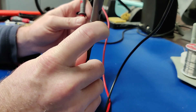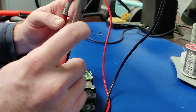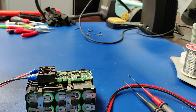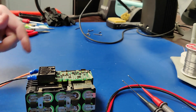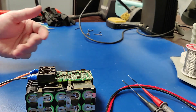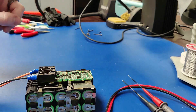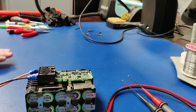Same with the rest of them. Basically I just watch it until it gets down to about 16 volts, turn it off, see where everything is at, and put it back on the charger. Some of these I've had to cycle them down about three times and put them back on the charger before it cleared any memory in the cells I just put in. Then it's good to go after that.